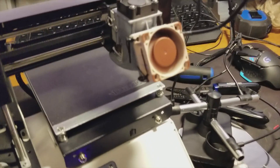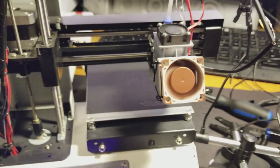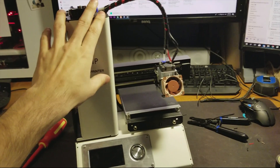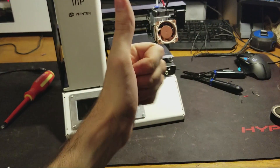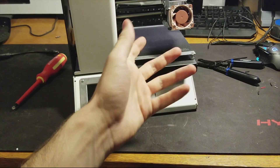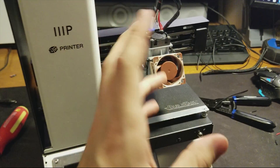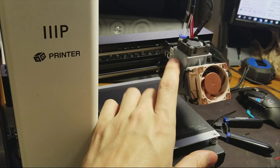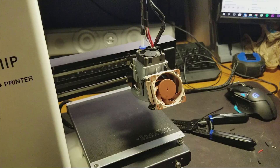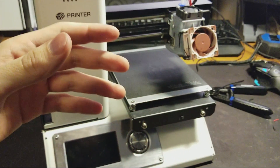And there we have a dual fan cooling solution for your MP Mini — that's pretty cool. I'm going to finish cleaning up. It is all done: shroud back on, all screws tightened, and the best part is I didn't have anything left over. I'll be doing a test print — probably a calibration cube or a cat — just to test the new cooling capabilities without changing anything else. I'll have the Thingiverse file link in the description, plus links for both the 40x20mm and 40x10mm Noctua fans.